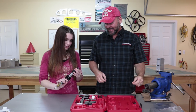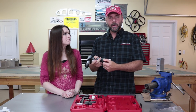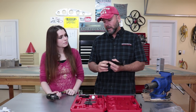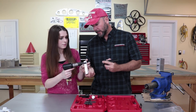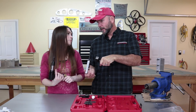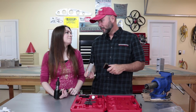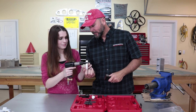The gun has an air valve regulator on it so you can fine-adjust the pressure aside from your air compressor. On the back side of the rivet, you place the bucking bar. You can hold it like a pen or however you're comfortable. The most important thing is to keep it perpendicular and flat to your project. If it's at an angle or sideways, it's going to slip off the rivet and cause it to pancake and form all kinds of problems. Hold it perpendicular — no longer pretty if you don't.